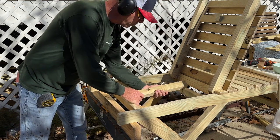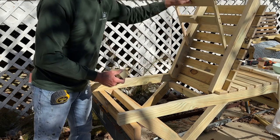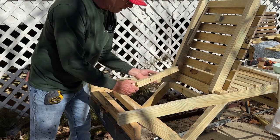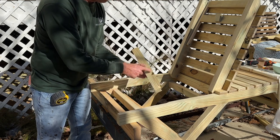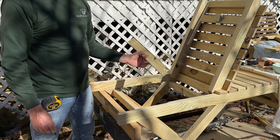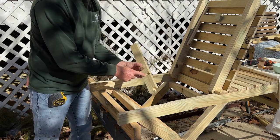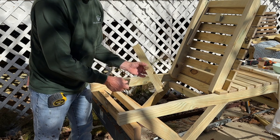And I'm going to complete some cuts here. But this is 3/4 inch. So I drilled a 7/8 inch hole at each location. And I'm still going to finish this 45 in a straight cut here to give it kind of like a gun rack sort of finish. And then I'm going to route the 1/8 inch round over on everything. I'm going to go to the bandsaw to make these cuts and then clean them up with the sander if I need to.